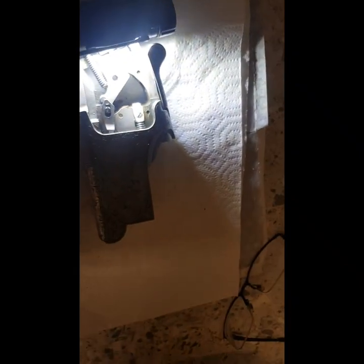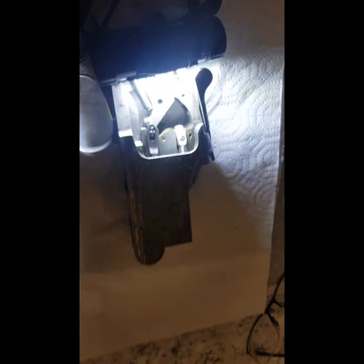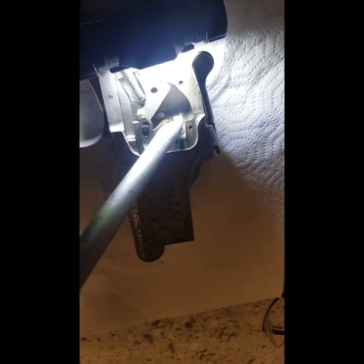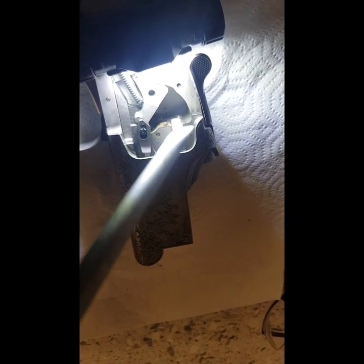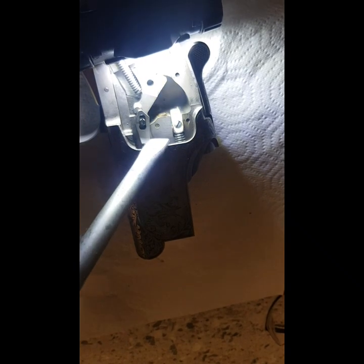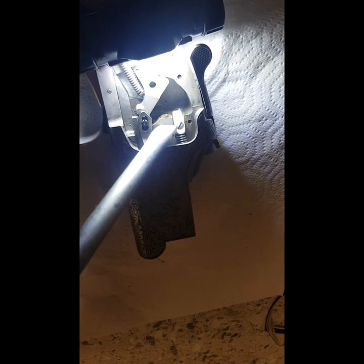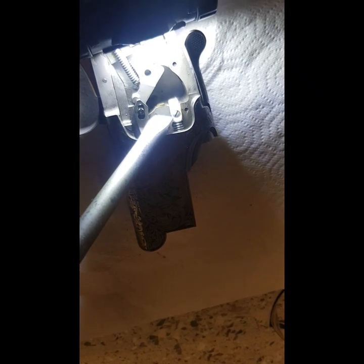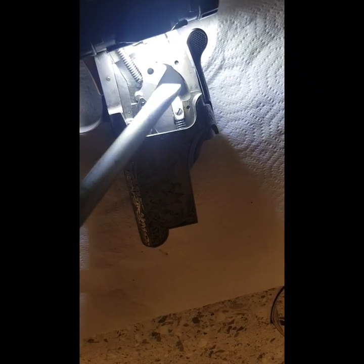I've set the torch shining straight in so I can point things out a little better to you. That area just looks a bit rusty underneath — that is the bottom firing pin, and that is the little locking pin there that is holding it in place. I need to knock that little pin out, and then there's a return spring in there as well.